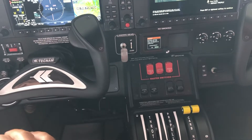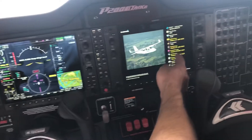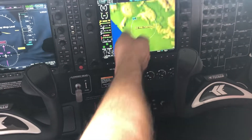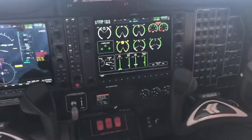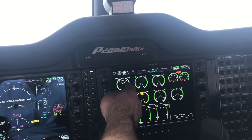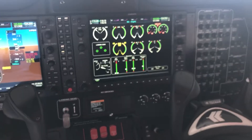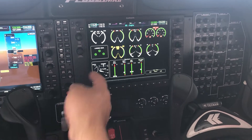We just press Enter — this is giving you the latest navigation data and expiry dates. Pressing Enter takes you to the engine page. On the engine page you can see manifold pressure for the left engine and right-hand engine, RPM left and right, fuel pressure left and right, and fuel quantity for the left-hand and right-hand tanks.